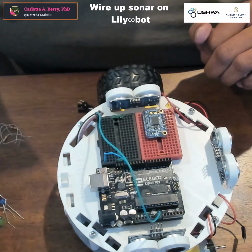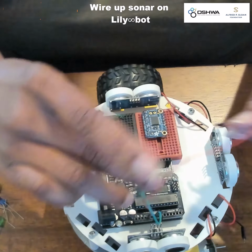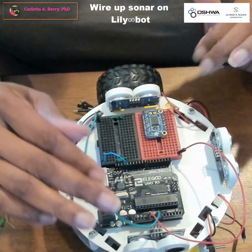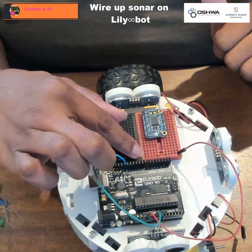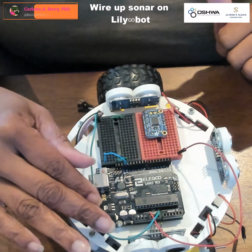And there's one 5-volt connection here. And we're going to connect that right here for our voltage bus. Note also that if you end up needing more voltage buses, you could do another jump from this row to the next row up if you need more voltage buses for your motor controller.